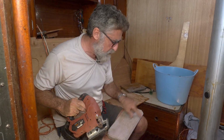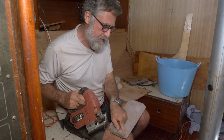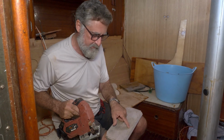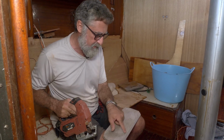I'm gonna cut a piece of wood to that angle and go try it. If it's right, yay. If it isn't, no problem. I'll adjust that angle, and then I cut the width of it. So I can cut back 3 or 4 times till I get it close to what I want it to be, and then measure and take it, instead of cutting it out and then doing the angle.